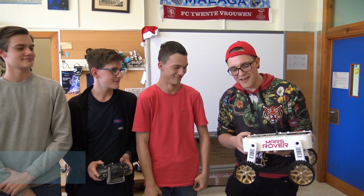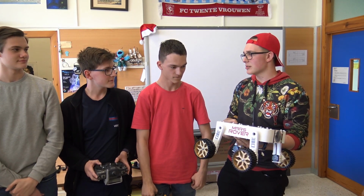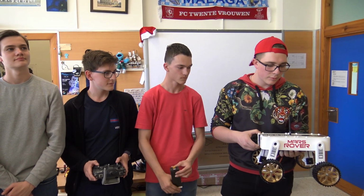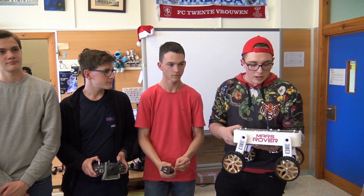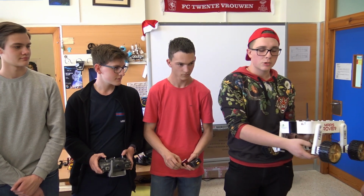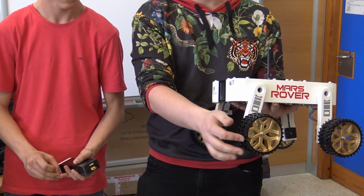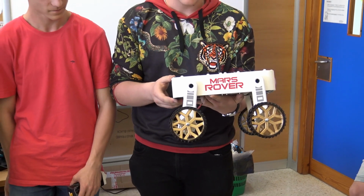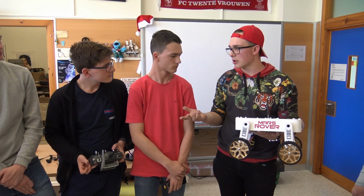It was a piece of art, because we were building it endless nights from 8 a.m. to 11 p.m. We didn't measure the amount of time we spent on the electrical things, and the main thing was our stepper motors were too weak, so we had to use gearboxes. The gearboxes were too weak, so the wheels are not tight enough, but it held for about a few tests.